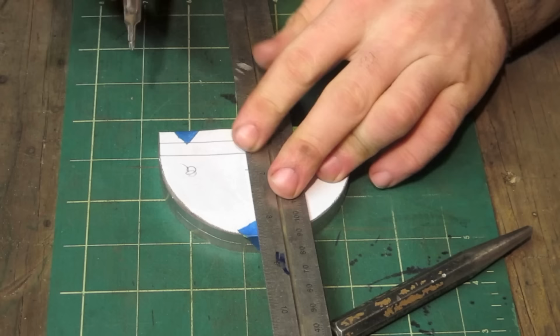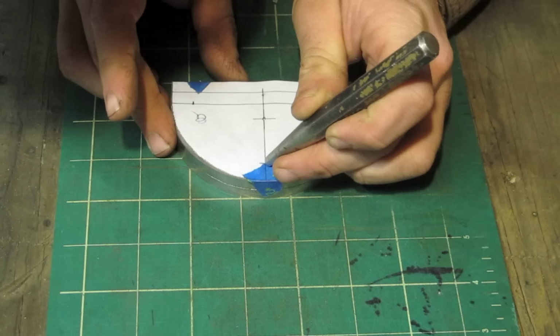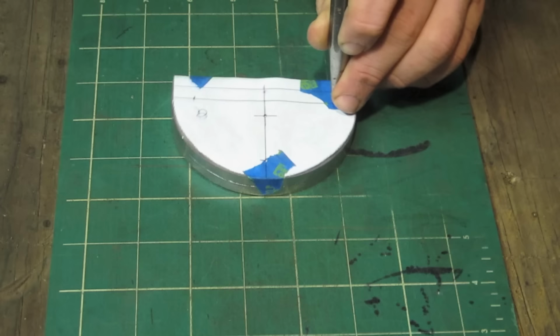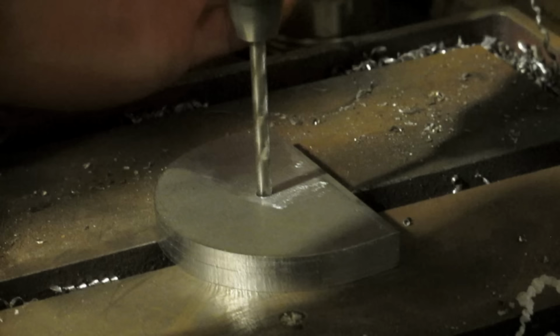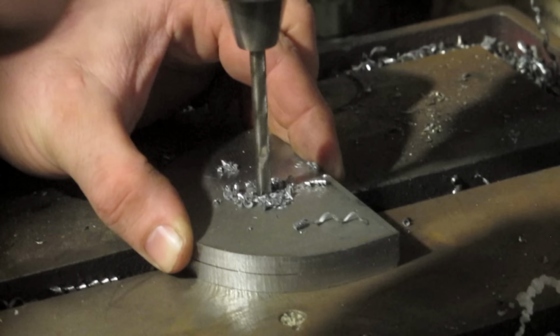I also had some other ones for the plug welds. They don't have to be as precise, seeing as they're plug welds. I'm paranoid about it not being in the center, so I'm drilling it out 5mm first, and then I'll widen it out to 3/8. It's for this pin and chain link type arrangement. The anime guy uses it to hang it on his back.